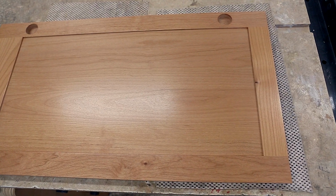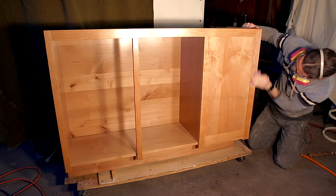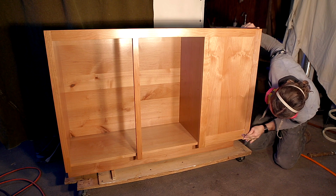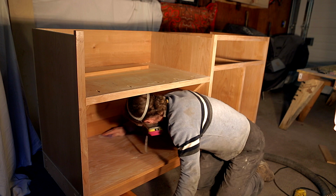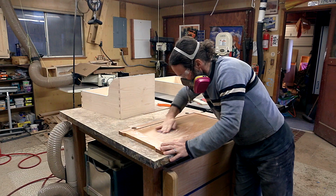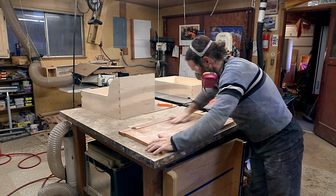After 3 coats, I could visibly see some bumpiness on the surface. I could also feel the roughness when I rub across it. So the next thing I needed to do was to start sanding. I used 400 grit sandpaper and I just sand it by hand to remove that bumpiness. I find that I don't really need a sanding block because you just kind of want to knock down the higher areas and get it to be rough. I usually would do this after letting it dry overnight to ensure that everything is totally dry and wouldn't have issues sanding it when it's too wet.